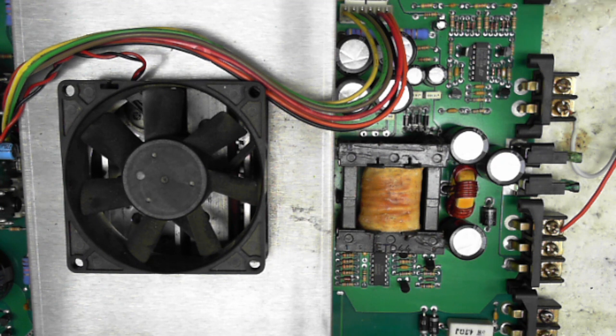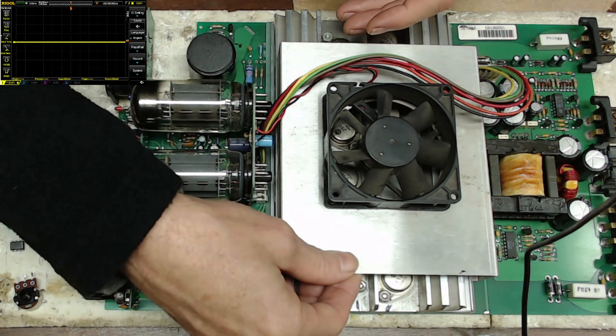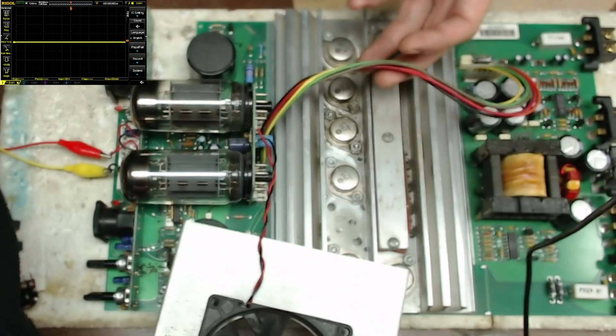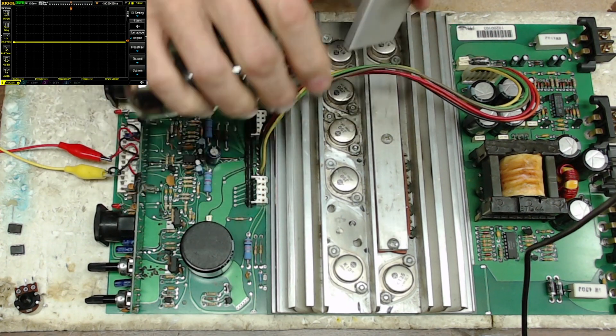On the first board I did, I can't remember exactly what transistor it was, but the 064 works perfectly and stays cool. It's a great replacement transistor for the power supply of these amplifiers. I just wanted to make a quick note on that. Let me remove the fan here to get it out of the way.